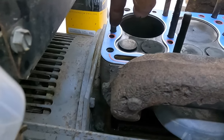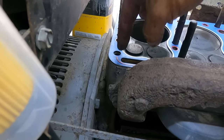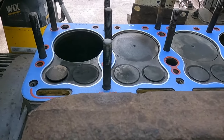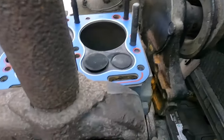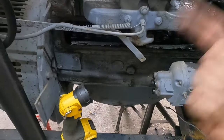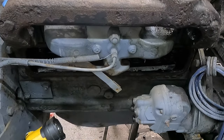And therefore, by using these and then torquing off of the other thread pitch, they're not gonna be quite the same. So I'm gonna try just real quick to get the nuts off of the other studs, and then I put the studs back in here, so forth. I'm gonna try that real quick, and then other than that, we're gonna put the head on, put this thing back together, put the carburetor back on it.